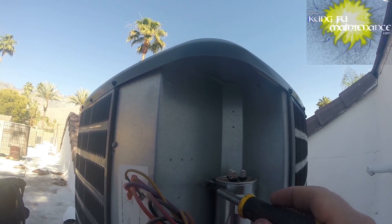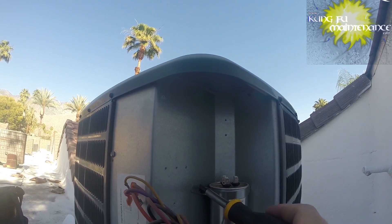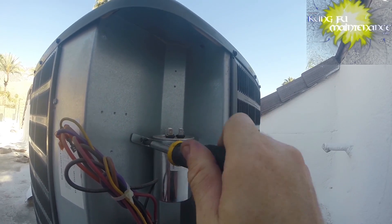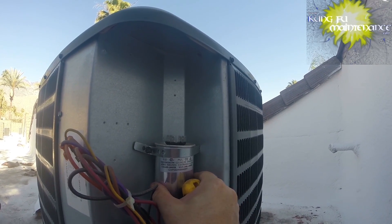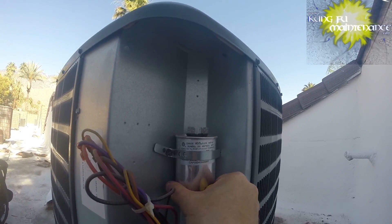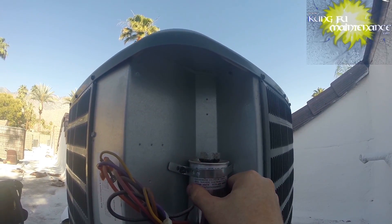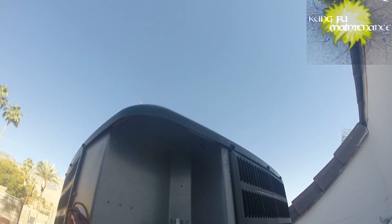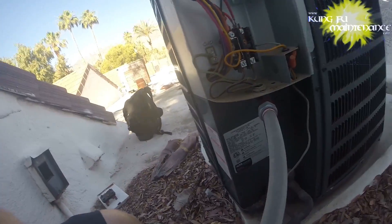The herm goes by itself on its own deal, and this one should be a 40/5. I'll rotate it around. It's got a QR sticker that you can scan and get information about the capacitor. I like to rotate them this way so we can see — yeah, 40/5. I'm going to set it right inside here and test it before I get much further, because we may very well be replacing this puppy.